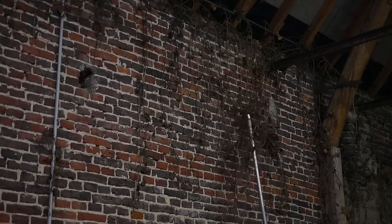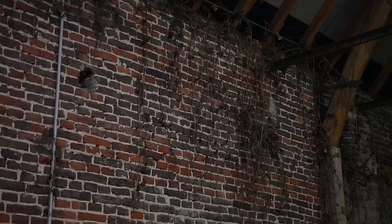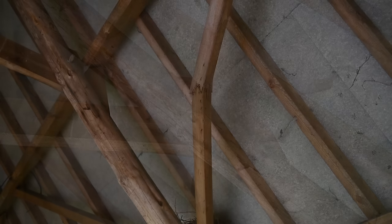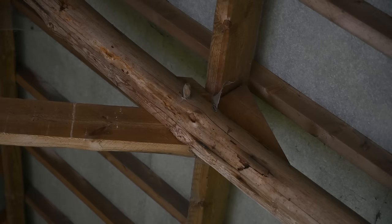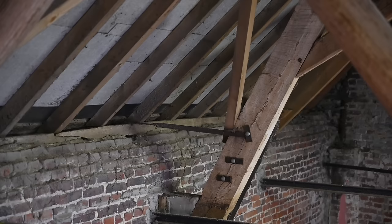There's lots of old ivy that came through the roof which I've removed on the outside, so all this stuff has to go. There's also a small support rafter that's broken — I don't know how, but it's certainly something we're going to replace. There was a good comment about how the beams are kept together with pins — that's very solid, how it used to be done in the old days. They last a long time unless they're rotten. They should typically be oak; I'll inspect them and see where they need replacing. In some places I've already added enforcement with metal panels and bolts.